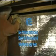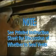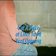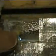Step 7. Find the vents that were covered earlier and cut the liner away as seen here. Note, various conditions affect whether it is advisable to seal the crawl space vents. Refer to the printed instruction sheet. If you decide to seal the vents, measure the vent opening and cut a piece of liner to fit. Apply the bonding sealant to the vent frame and press the cut piece of liner into place.